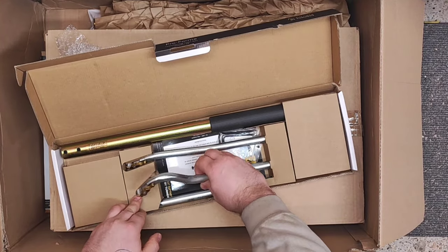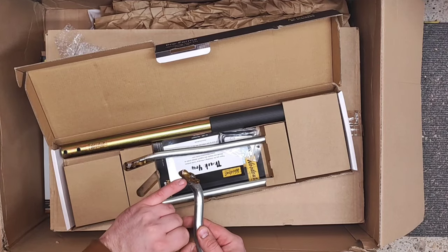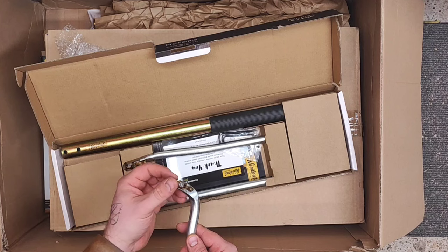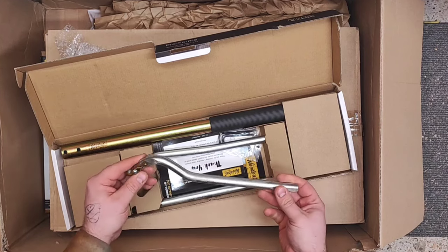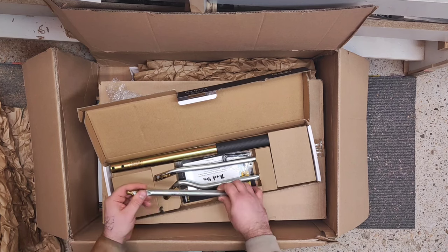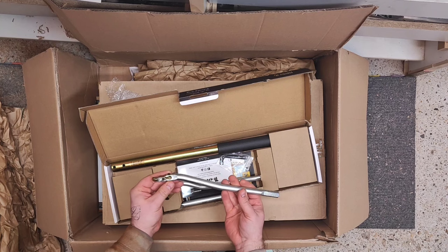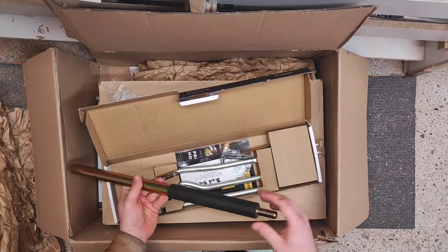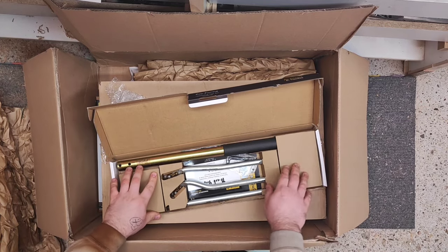Let's open up these hollowing tools — they are really nice, hefty ones. You can see this is quite a solid shaft, I think 16mm diameter. Their design here lets you control how much material to remove — you can shorten this so there's just a little on the tip, taking a really light cut and it's not that grabby. I have a gooseneck version, a straight one, and a slightly less curved one, all on the same principle, with a nice beefy extendable handle.